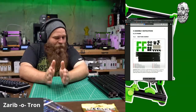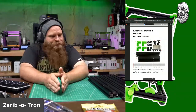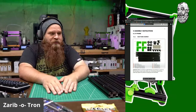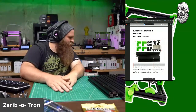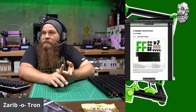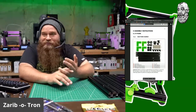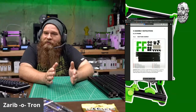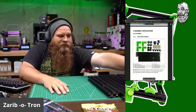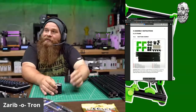So I'm building a 320Z Zaribo, so it's the Zaribo 320. So 30-30 extrusion, 320Z height and build. Same bed as a Prusa, so the same 250 by 210 bed size. I did order the custom carriage, the Y carriage, so it can use the bearing blocks. It's also going to use 10mm rods. So 10mm rods on the Y, the Z, and the X versus the Prusa 8. I will be installing fatty LDO 0.9 motors on the X and Y.